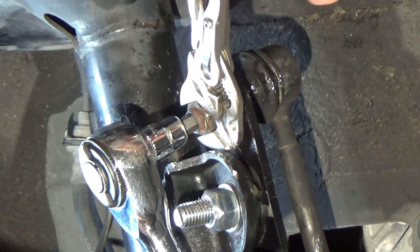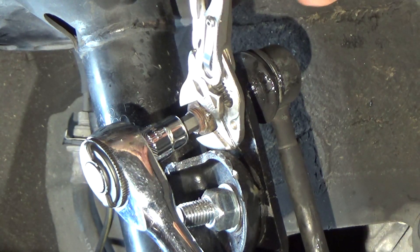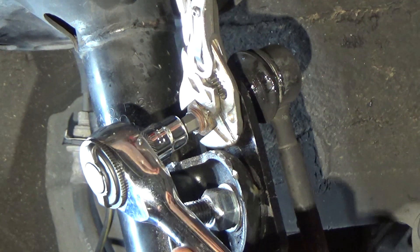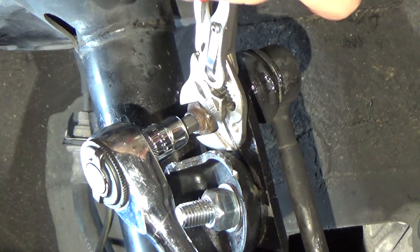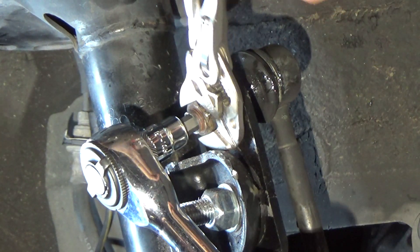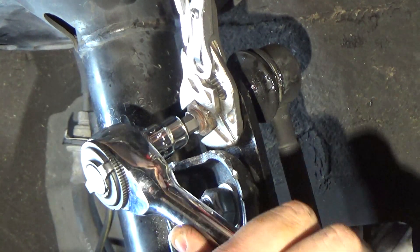While this is slow, it will give you enough room to place a pair of pliers behind the nut on the threads that you will no longer use. I can't stress enough that if you place a pair of water pump pliers in front of the nut and try to take it off, it will make it much harder as you will ruin the threads that you will eventually come to while loosening the nut.